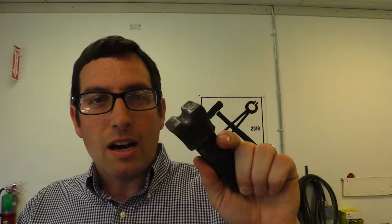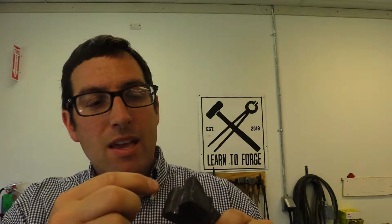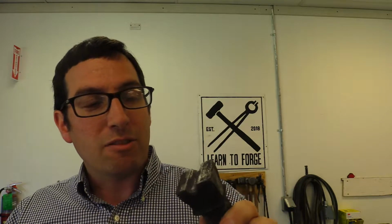The tool here, where I meant to upset the flange and it spread out, it left too much material in the spine, so I'm gonna either have to make a new one, which will make a good video later. But what we'll end up doing, you can see here, I tried upsetting the edges of it, trying to get those flanges to come out further, but in the end I just ended up flattening it the whole way, as you can see here, and then created my shape from there.